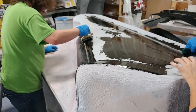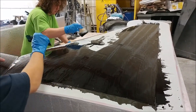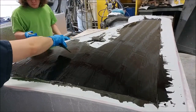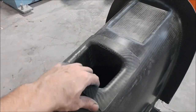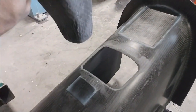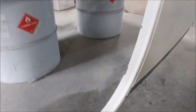The right upper strake skin finished all its coats of wax, so the guys are now putting down the black top coat in preparation for laying up the mold. Roberto and Chris are in over the weekend laying the first layers on that one. I also had to do the cutout in the keel for the aileron insert — where the control stick for the aileron goes through and runs down the center of the keel. I also mated the floor braces to the keel with a little sanding, though I didn't get video of that.